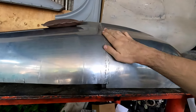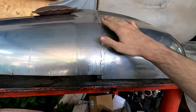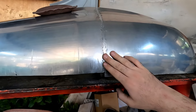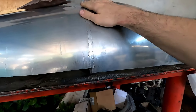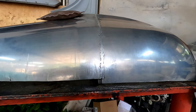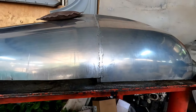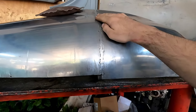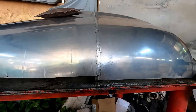When I work a weld, I start off by stretching over the whole length of the weld first, because the weld will shrink over its whole length. I've just gone in and worked a couple of passes over the whole weld, and once I was happy with that, I check how the panel is flowing — anything that's low I'll work that specific section. If I make any high spots I put a sandbag behind the high to support the panel and then just lightly tap the high spot down from the top with a hammer or slapper. After that, I grind the weld to pretty much flush over the whole panel, and then do the same on the back — grinding it mostly away. Having worked the weld, I won't need any more material to stretch up. It's all pretty close now, just a little stretch and shrink to work the whole panel and get everything flowing nicely.